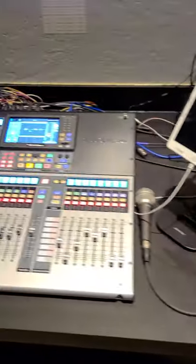The reason I show you all this is because it does matter what order this stuff gets turned on in. The speakers should never have power when either the Jupiters, which is our distribution in Rocky's office, or the sound board gets turned on. The reason for that is both of those components can send phantom signals, pop signals, things like that.